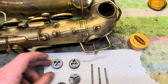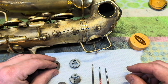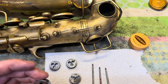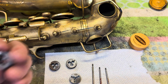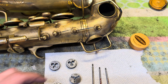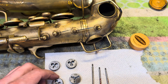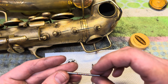The problem is that we've been using UNF and UNC dies and taps when what you need is NF. They are a very slightly different standard, and it's somewhat confusing because you can adjust these dies open and shut to make things a little bit better. The newer UNF/UNC standard is backwards compatible with NF and NC, but it doesn't work the other way around.